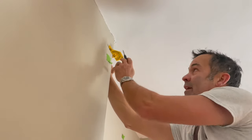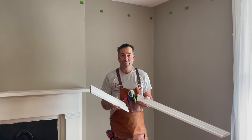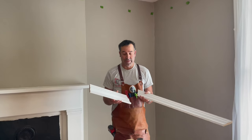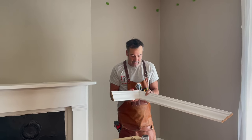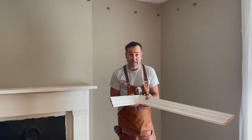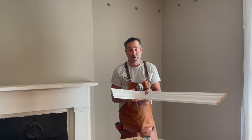A perfect example: the angle for this outside corner is 94 degrees. Inside corners are a lot more forgiving when you cope the moldings, and I'm going to show you how to do that a little bit later. Coping the moldings gives you a way to adjust the angle slightly, as opposed to an outside corner that has to be exact.